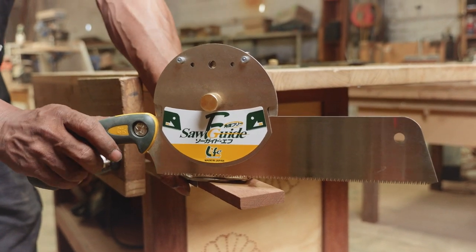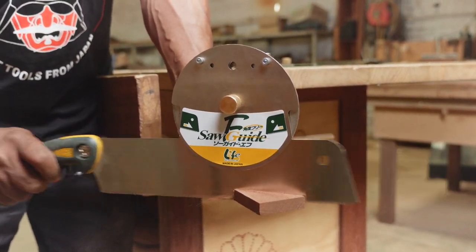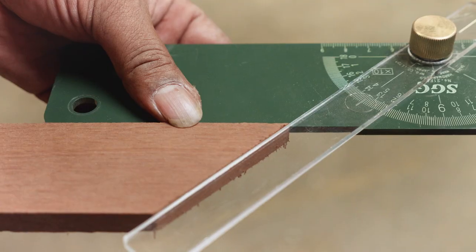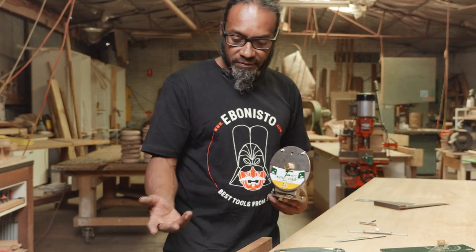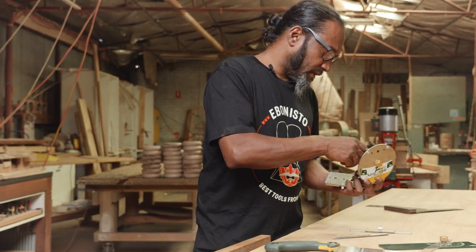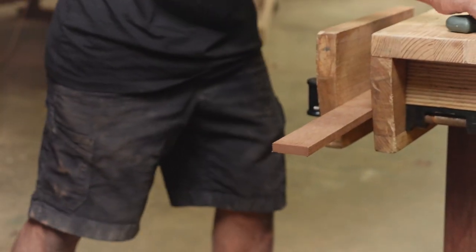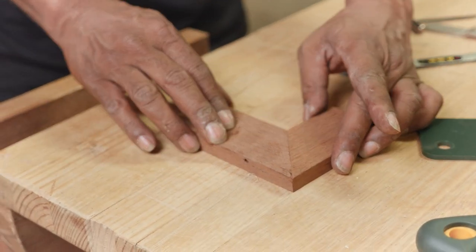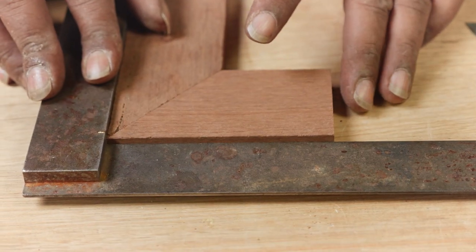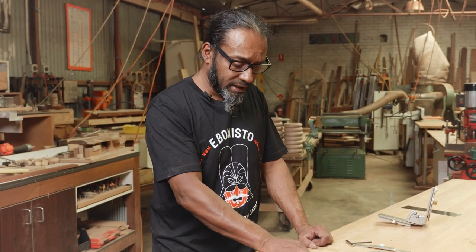Keep this fence firmly pressed against the wood. I've set my protractor at 45 because it's always good to check the angle and make sure you've got the right angle. You can see there are no gaps — the angle is very good in fact. So this is very useful if you're making mitered frames like picture frames, or when you have to do skirting. Join the two pieces — this is a very, very nice clean cut. As you can see there are no gaps and that's a perfect 90 degree joint. Much easier than using a drop saw, and actually quite fun to use.